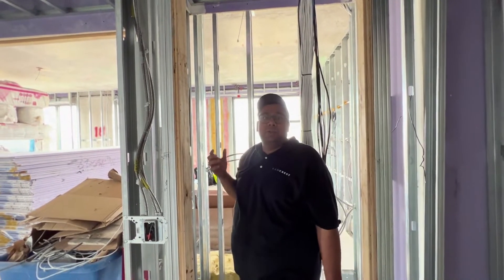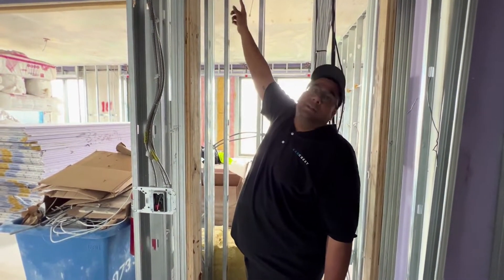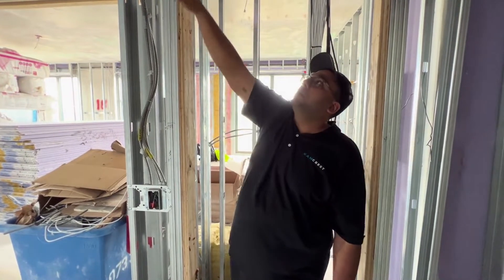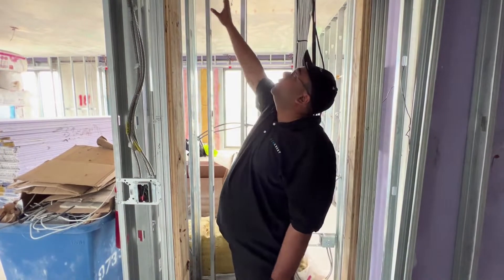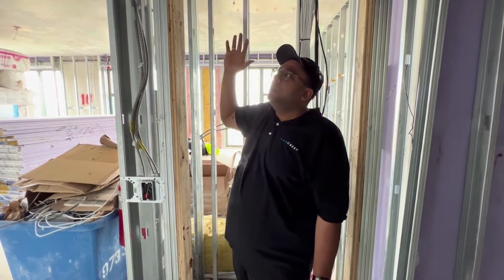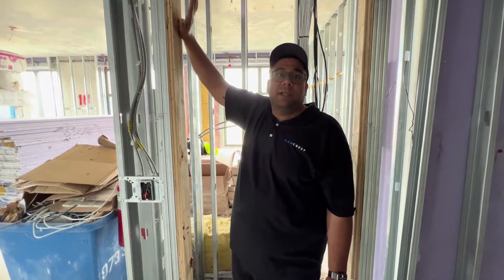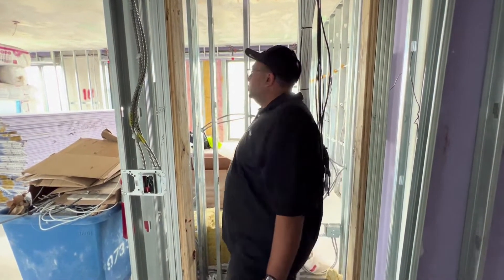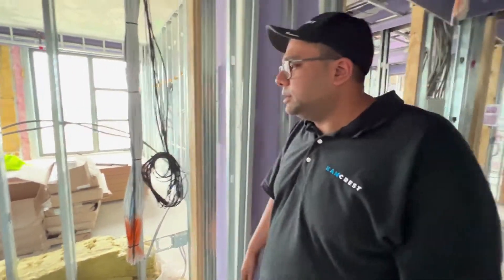I'm not expecting a lot of heat issues — you only have one amplifier. But we can basically cut a ceiling vent fan in here, and it will eject the heat into this cavity. So I'll figure that out, but we don't really need a full legit vent coming to this closet — we can just inject into the cavity for heating. So this is basically the overall closet: fiber wires and all the low-voltage Ethernet and coax.